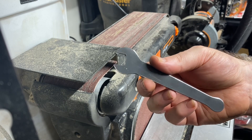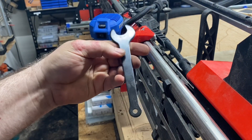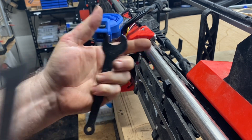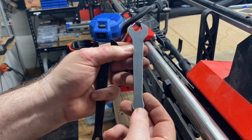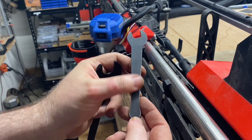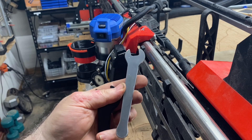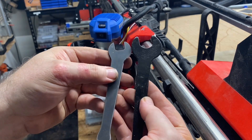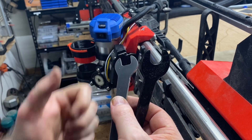Let's go test it and see how it works. Just for comparison — that's the original Cobalt wrench, 17 millimeter span, three millimeter thick steel — and this is the one I just cut using my LowRider 3. It has a plasma torch strapped to it; I'll put a link in the description to that plasma torch, it's a Hypertherm Cut 60DN, which comes with a non-high-frequency start so you have less chance of interference. It's got nice features suited for use with CNC. There they are side by side, and now I will try the two-wrench method.